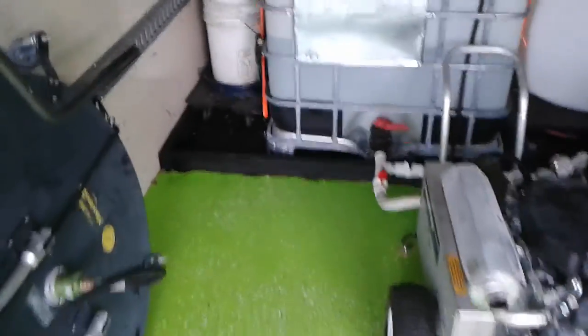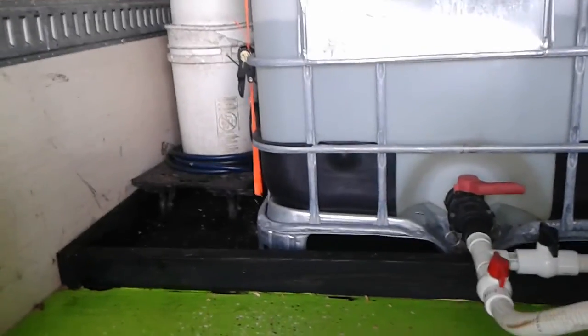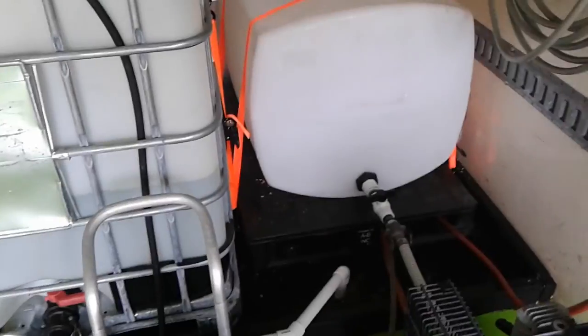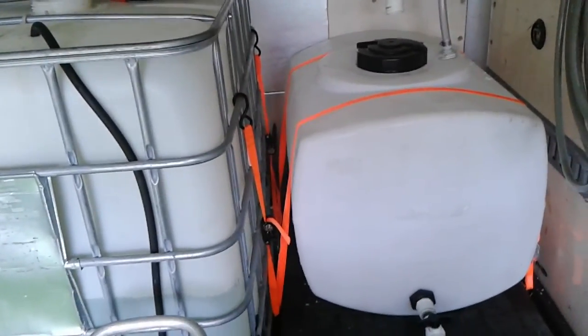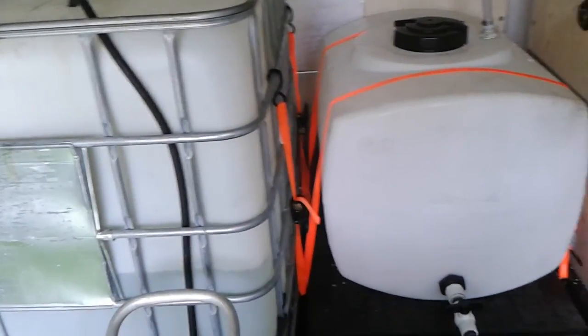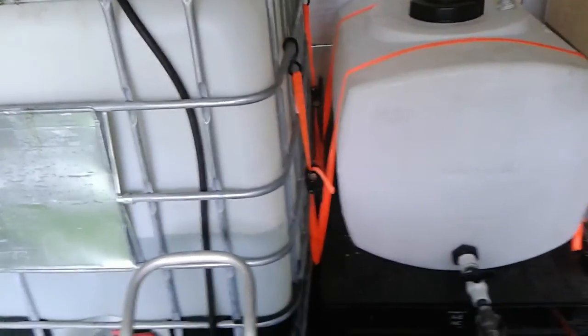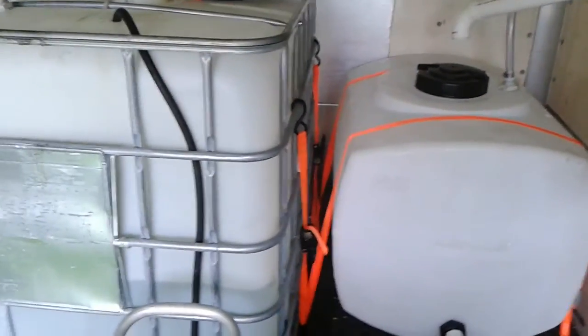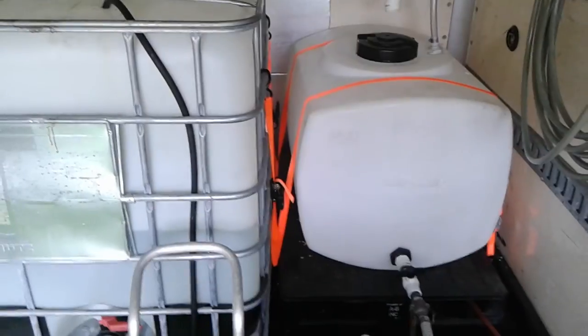In the floor, you'll see a slightly different setup back here. We made a box on the floor, siliconed around all the edges, and then had it Rhino-lined. The purpose of this Rhino-liner is that this tank is our mix tank for our roof cleaning agents, which are very caustic. If we were to spill that, it would corrode and destroy our equipment. So if anything were to spill, it all stays contained in this box, which has 10 two-inch drainage holes throughout. It stays contained and just drains out the bottom, keeping it away from all our equipment.